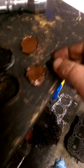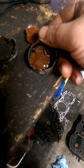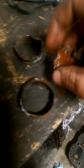Start taking your screwdriver and driving around in a pattern so that you're basically chipping away at it. You don't have to take a Dremel or a skill saw or anything - just get a hole started, keep hammering around and around. Eventually it becomes like a tuna fish can where the lid's kind of poking in. You can reach inside with the screwdriver and pry it back. Keep working until you've got maybe three-sixteenths of an inch still connected, then reach in with needle nose or get the screwdriver behind it and pry the center part out.